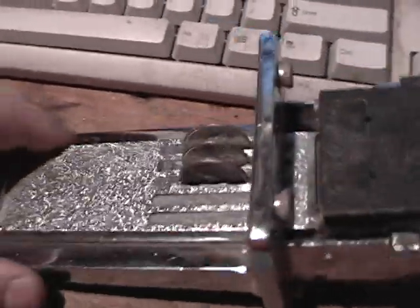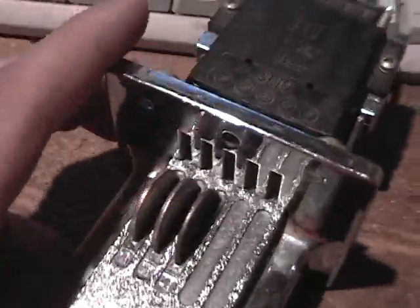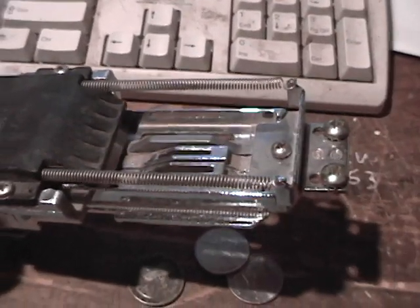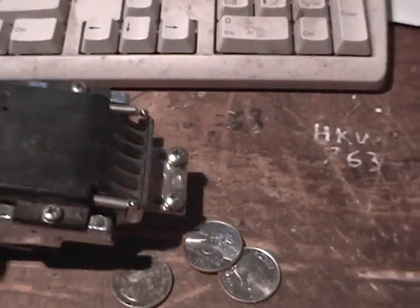Basically, I'm going to show you real quickly how it works. Now I've got three quarters in here. You can change the price settings on these and I'll show you how to do that in a little bit. What happens is, you push it in. It's got a ratchet so you can't do it more than one time, and there would be an actuator on the back of this — it would hit a switch or a timer, something like that to start the operation.